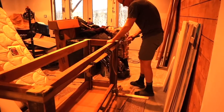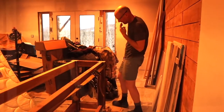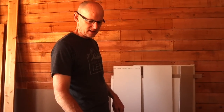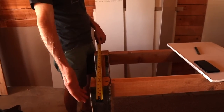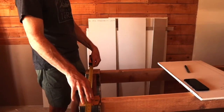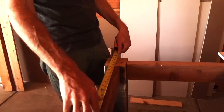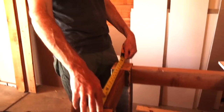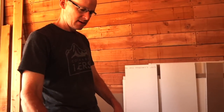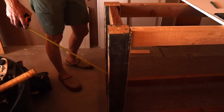Here they're ratcheting up the vanity to secure the gluing and making sure everything is square. Brian's double-checking while it's drying to make sure it's all in position. It's complicated making furniture while winging it with no plans. The top goes four inches off the back to leave space for plumbing, and it comes out to 25 inches — that's where the milled log slab will go.